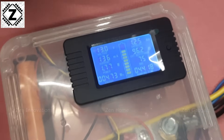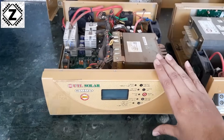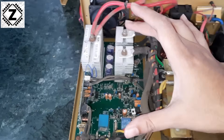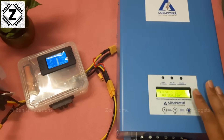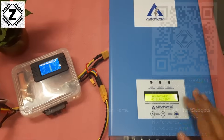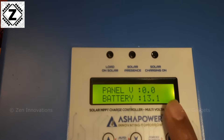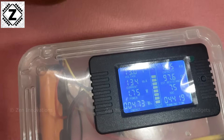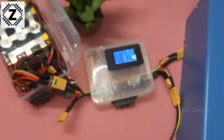I'm really happy to report that these kinds of MPPTs consume a very limited amount of power, especially when compared to heavy-duty inverters or other devices. Inverters themselves have really heavy components — for example, a heavy-duty transformer, various PCBs and displays — and hence their idle draw is slightly higher. But here the idle draw is very negligible, and you generally should not worry about your battery draining overnight just because you have a bunch of MPPT solar charge controllers connected to your system. Let's verify accuracy by looking at the displays: the meter shows 13.1V and the MPPT shows 13V — a very acceptable accuracy. The idle draw is under 2 watts, around 1.77 watts.